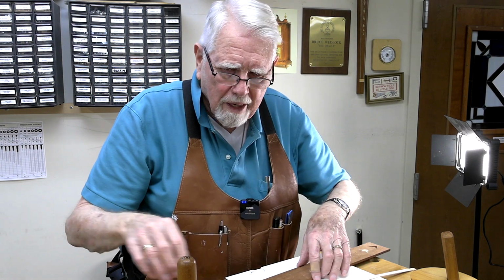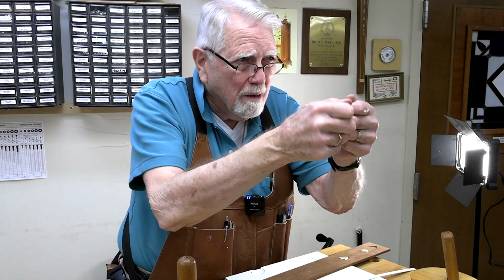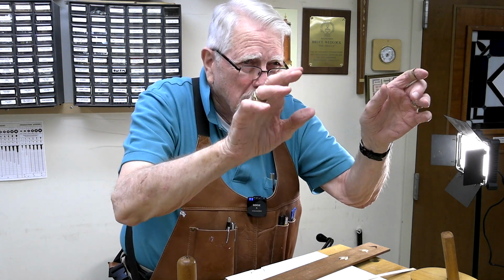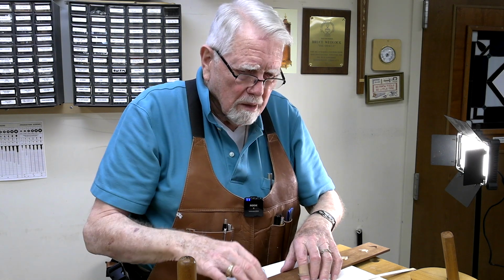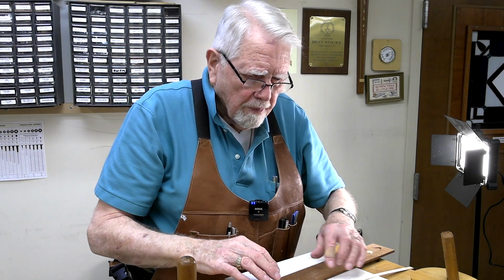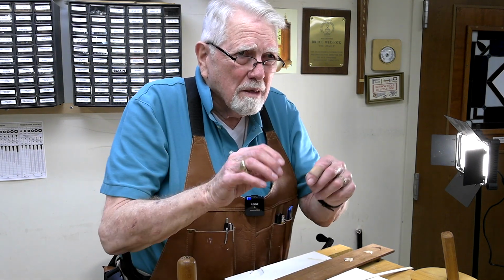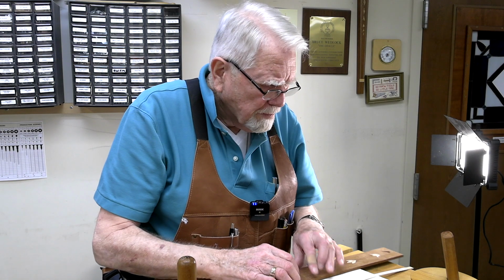Take the piece of veneer. Oh, I don't have one here. But you can bend it with the grain curved easily. Try to bend it against the grain, you got to push it much harder. So you want that thing cut so that, but that works really very well. Just slap that on there, clamp it down, you can put as many clamps as you want on it, just tight, and that's described in the article on how to make the table.